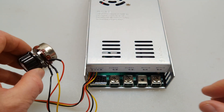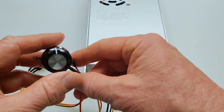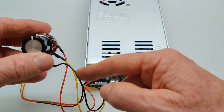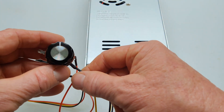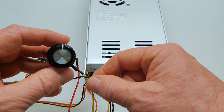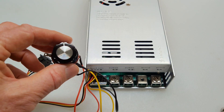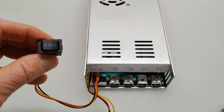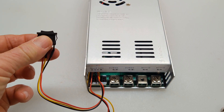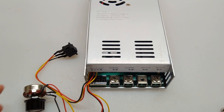The other thing is that there's no on/off switch, which you'd normally find with these PWMs. Normally there are five wires — two that go to the on/off and three that go to the pot. Because there's no on/off, you can take it all the way down to zero percent in either direction. But if you want to use it as an on/off switch you put it in the center position. If you want a true on/off switch, you're going to have to add it into your wiring.